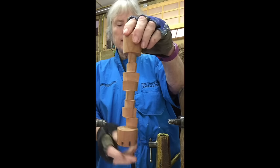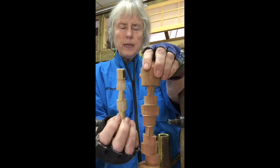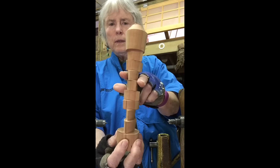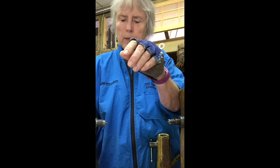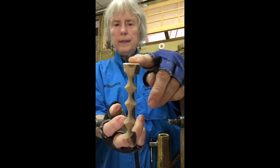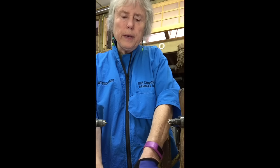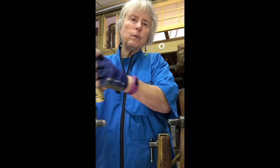And on each one of these axes, it's very similar to the one I showed you here, but instead of each axis being 90 degrees apart, each of these axes is 45 degrees apart. So there's one, turn it, there's the next one, the next one, and so on. Here's the one other one. These are parallel axes. They're coves that are opposite from each other. Here's just a few of the spindles that I turned that are found in quadrant one. There are many, many more. And from these initial ideas came a lot of other work that I've done.